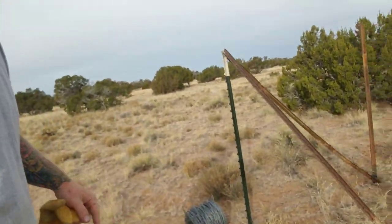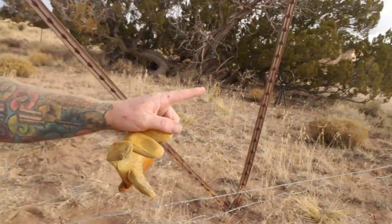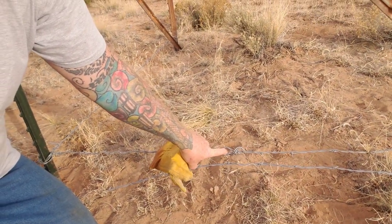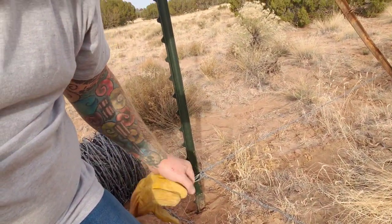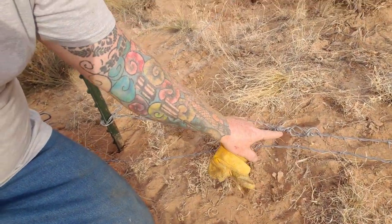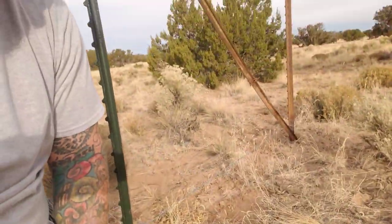I don't have a fence stretcher, but I do have a come along, and so I've been running the wire down. So this goes from that corner all the way to here, and I just made a loop and hooked my come along through, and then hooked the come along to this side, pulled it tight, and then looped barbed wire through the loop here, and then with my body weight pulled that as tight as I could before releasing the come along. And that has been, you know, you could probably play a pretty good banjo tune on the fence here. I've got a line of barbed wire on the bottom and the top all the way around,